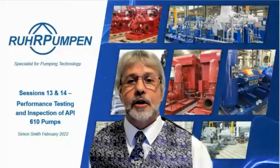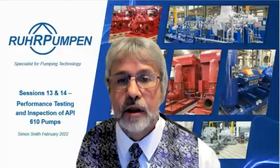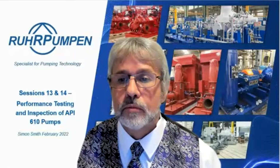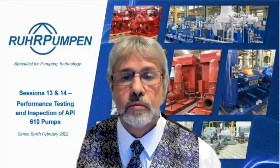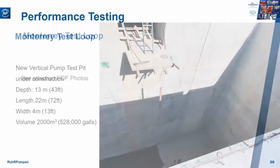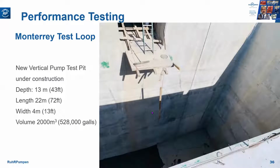Stop the chair there and go back to the one. Here we can see the new vertical pump test pit at Monterrey, Mexico. It's under construction at the moment, so it's a work in progress. 13 meters deep, 22 meters long, 43 feet deep, 72 feet long, 13 feet wide, and holds 528,000 gallons. That's a bit more than 2 minutes retention time, I would suggest.